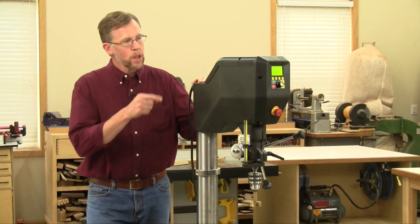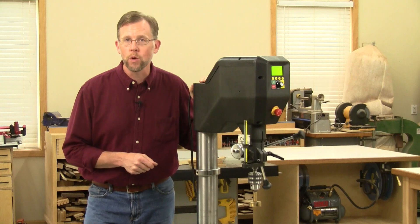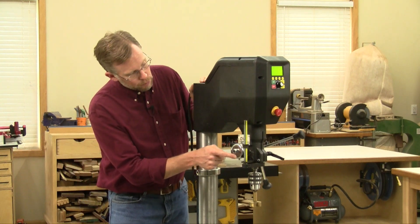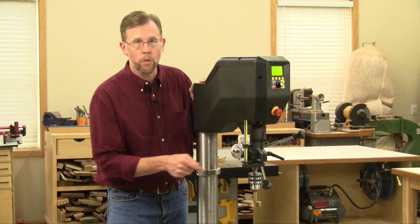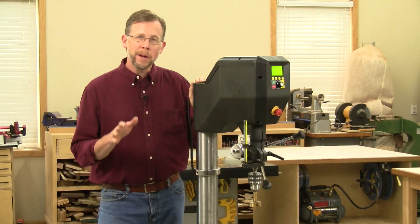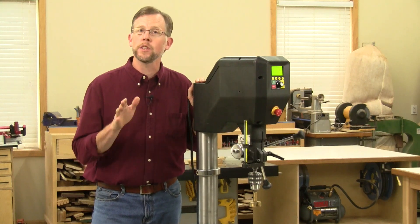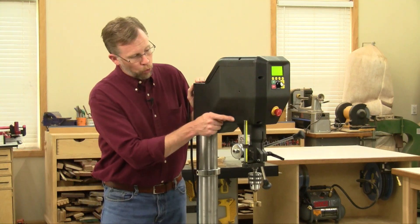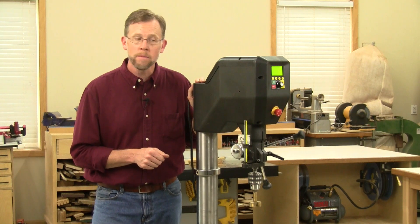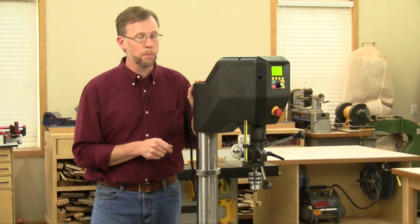Here's my third favorite feature: Voyager comes with electronic depth stop control. We all drill stopped-depth holes from time to time for mortises, counterbores, cup hinges, and that sort of thing. The process on a standard drill press involves shifting a pair of stop nuts on a threaded rod to stop the quill travel at some point, but it's kind of a hassle to set up, and if those stop nuts aren't tight against one another, they can shift and change your depth setting. Voyager does come with this manual depth stop system just like other drill presses, but it's really an unnecessary feature because you can set depth stop using the computer.